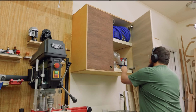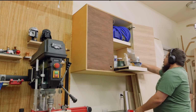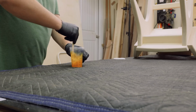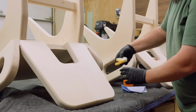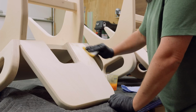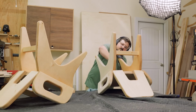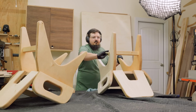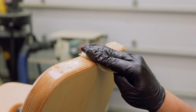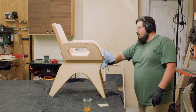Alright, with the new finish cabinet open, the finish line's in sight. And for the finish on this piece, I'm going to be using Rubio Monocoat Pure, which again probably is not a shocker to the casual viewers of the channel. But for anybody who's not, first of all, welcome, and the reason I like using Rubio Monocoat is because it's incredibly durable and it's easy to repair if I need to do so in the future. There's also not a lot of sheen that comes through with this finish, so the matte look allows for the natural beauty of the lumber to shine through, and I'm a big fan of that. Not to mention, it's incredibly easy to apply, and if I'm being honest, finish work isn't my favorite work to do. So, with the finish finished, let's take a look at those glamour shots.